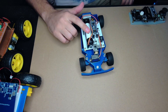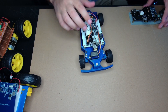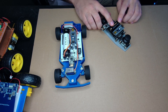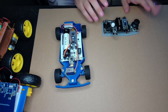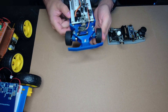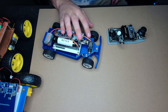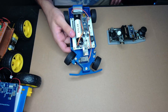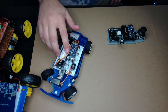This is another custom PCB, which uses one 18650 battery. It uses an Arduino Nano, and this is the NRF24 module, which connects directly to another NRF24 module on another custom PCB right here — the controller. This uses a smaller battery and another Arduino Nano. It has a little joystick and buttons. This thing actually came out very nicely; I was very happy with it. This uses standard geometric steering — it operates similarly to a rack and pinion. It uses a little servo that twists these arms, and it uses something called Ackerman steering geometry. If you notice, one wheel is pointed more than the other one — this is how cars actually turn, and it keeps the wheels from slipping during a turn.